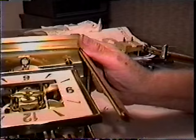Okay, now when this pendulum lays at rest, see if I can stop it here. Where it's at zero position. This roller has to be looking right straight at you, like so. Pointing out straight when it's at zero, dead center. And just loosen up your screw and put it on center. That puts the clock in beat. Okay? That's why I put the crossbar parallel with the suspension spring, so it gives me almost a presetting to put it in beat.